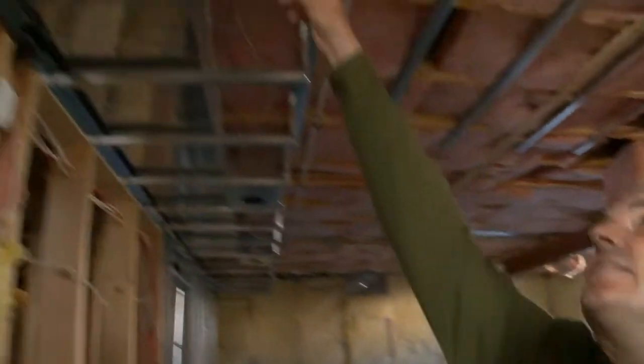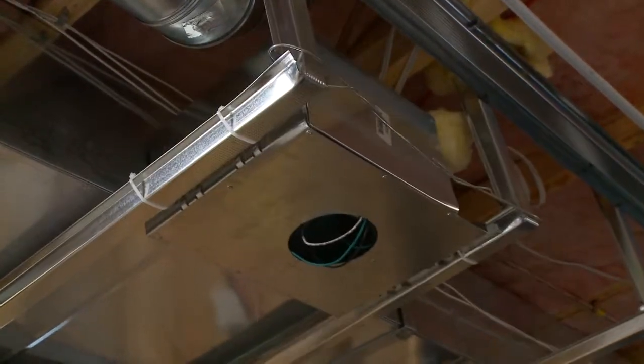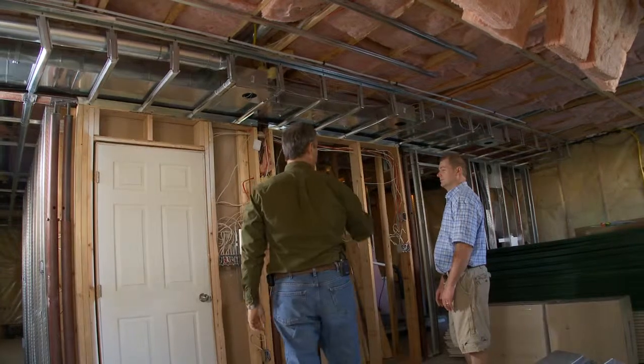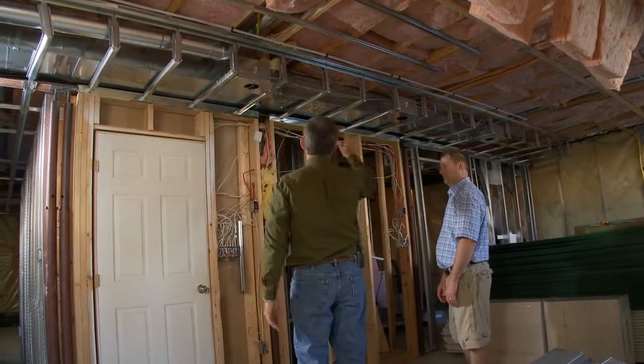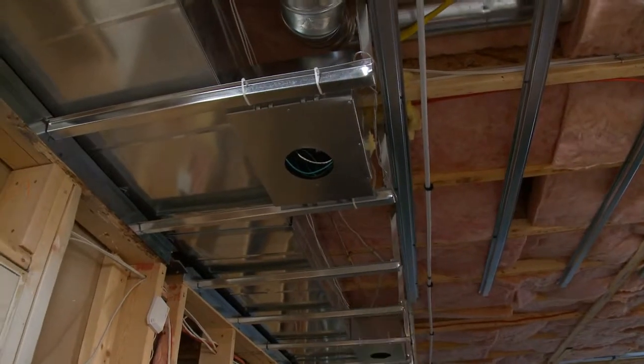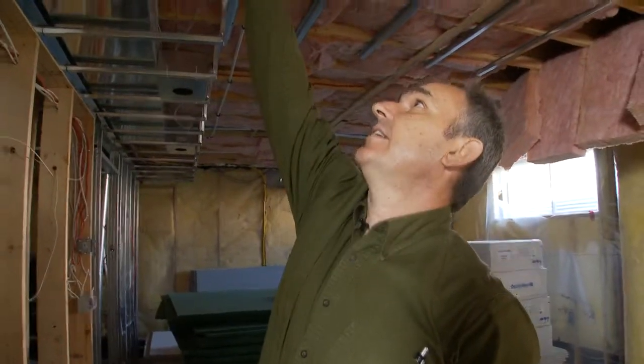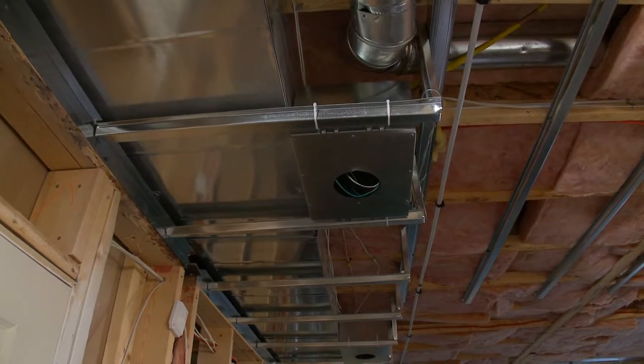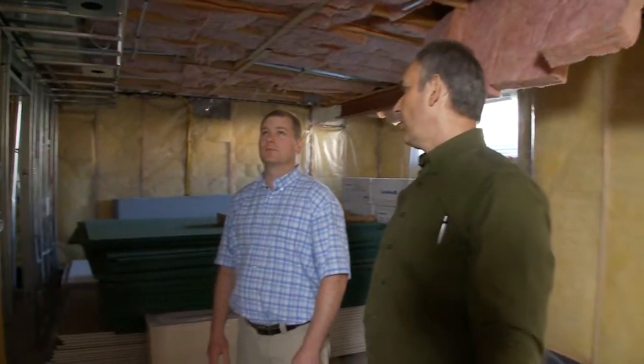Here you can see how they fastened this pot light. This pot light is fastened with belt connectors. Normally this has a metal sliding U-channel that is attached mechanically with a screw to the other members. That gives you rigidity and you don't get this kind of thing. Because even if the drywall is on there, you're still going to have it crooked, and it certainly won't look good.